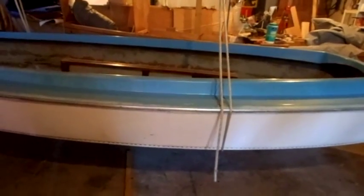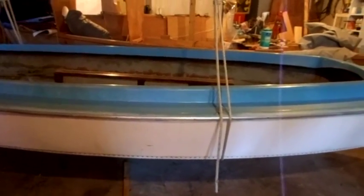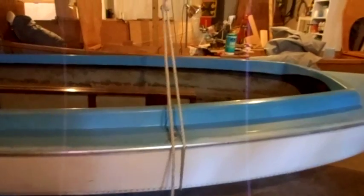I've raised the boat up off the trailer and moved the trailer out because the weight of the boat itself was causing the stringers to snap — snow load over the winters and everything else. These two pieces I just ripped off were so loose. I'm going to have to come up with a new way to install those. And it seems like every one of them is cracked, or just about.